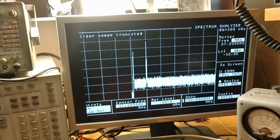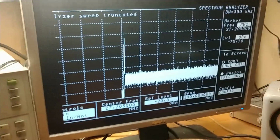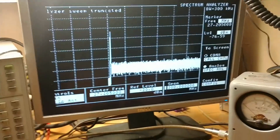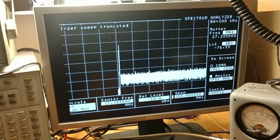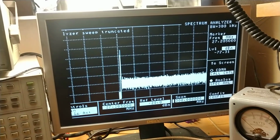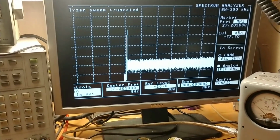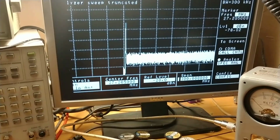Audio. Well, I don't have the right slug in, but right there it's 30 watts, modulating about 120, right in the neighborhood of 120. So, all the way up like that, and you can talk like that till the cows come home. I mean, this radio will hold up and talk real good right there.